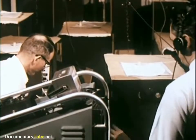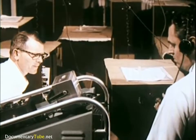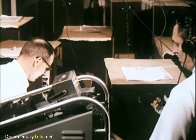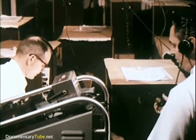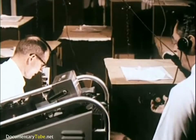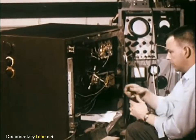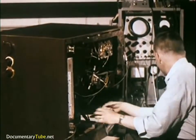Samples of finished sets are selected for the life-testing laboratory where they are tested from 50 to 2,000 hours. The sets are continually turned on and off — on for 105 minutes, off for 15 minutes — to subject them to alternate heating and cooling. Throughout the tests, technicians using sensitive testing equipment keep a close clinical report on the action of each set.